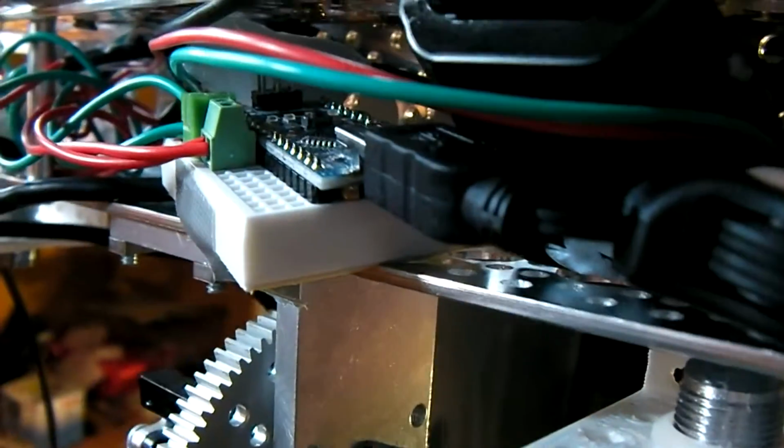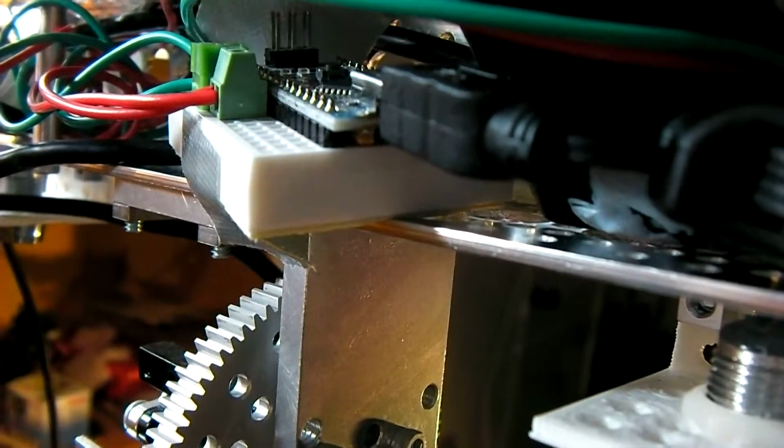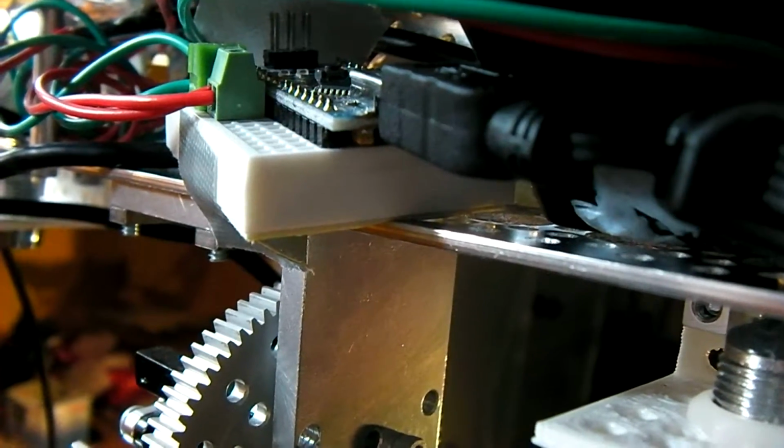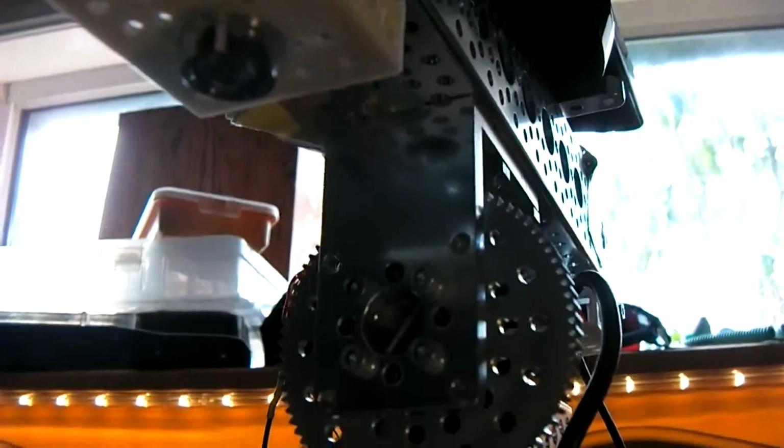At the top, this Arduino here is actually hooked up. The USB goes straight through that slip ring. Arduino USB is fine. USB 2 speeds are not fine through that quality of slip ring. That Arduino turns on and off these LED lights.